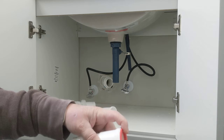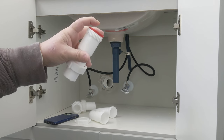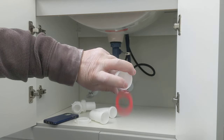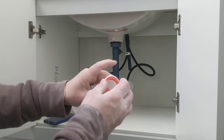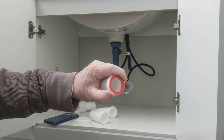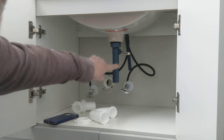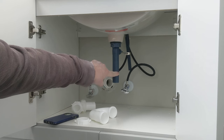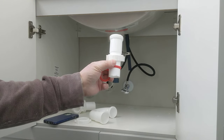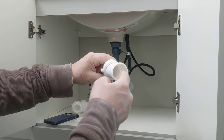This is what you'll have — inch and a half here — and you'll see how it fits in there like so. It turns that hole into an inch and a quarter hole. This is all you need to transition from your stopper tailpiece to your trap tailpiece: just this washer, inch and a quarter to inch and a half.